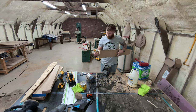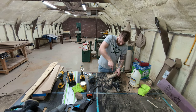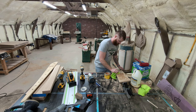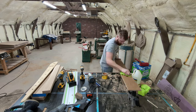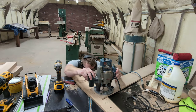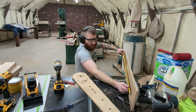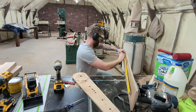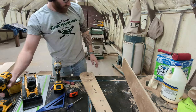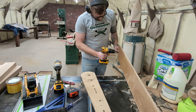I'm gearing up to cut out a circle, and in my opinion, one of the worst things you could spend money on is a circle-cutting jig. I just grabbed this scrap piece of MDF. All you have to do is pre-drill holes that line up with your router, grab some screws, run them through the bottom side, and rub paste wax all over it. Plunge the bit through the router to get a measuring reference. Then measure from that reference hole out to your desired radius, make a mark, and drill another hole. I can add more holes as simply as drilling an additional one.